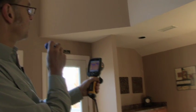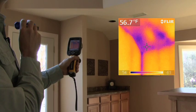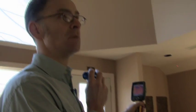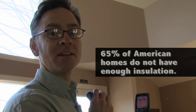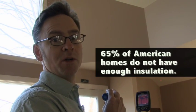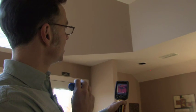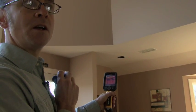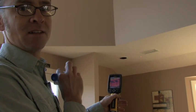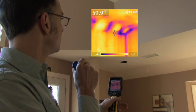Also, up above, the very corner of the wall is showing up as very cold. That's typical because when this building was built about 15 to 20 years ago, we often left those corners uninsulated or we built our corner out of all wood, which is not the best insulator. So it's showing some very typical problems. But the little surprise is up above it — in that little bit of slope, we can see it almost looks like, assuming this is insulated with batt insulation, there are some batts missing right in here and right in here.